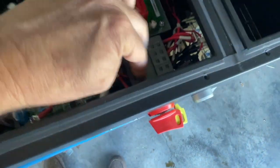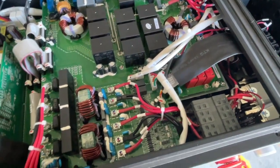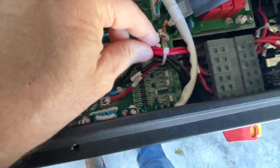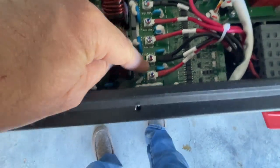This is your switch here on the outside, and that's your rapid shutdown switch, which basically controls the relays. These are your DC strings coming out and all of the DC commons in here.